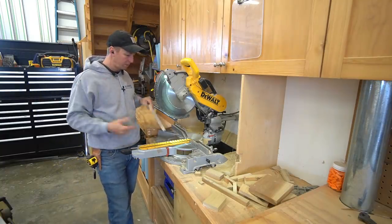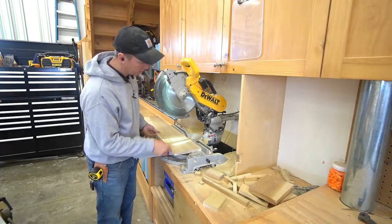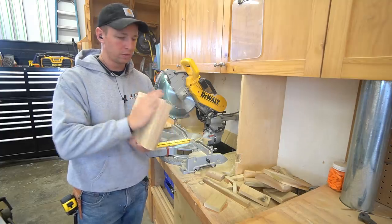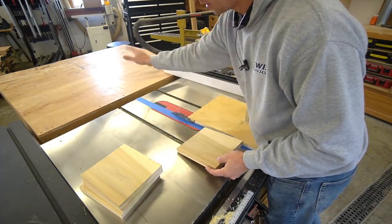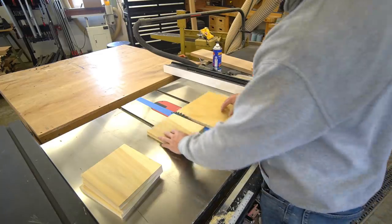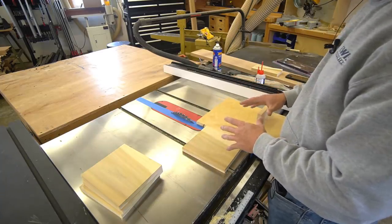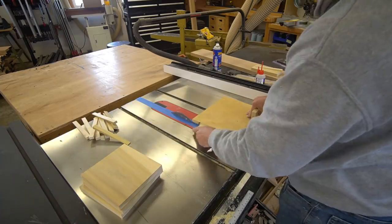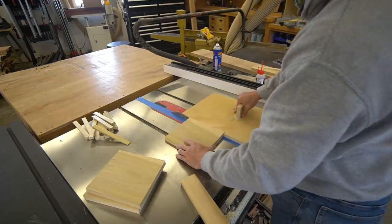It's time to make some shims. Just grab a piece of scrap and mark on your miter saw the length that you want — in this case I know I want eight inches, so I put a pencil mark there. You can batch cut a bunch of pieces to length really quickly doing it that way. The best thing to do would be to have a bucket on the backside where these shims could just fall into, but since my outfeed table's in the way I'll just push them to the side. You really got to watch your left hand — you could very easily cut yourself. I love having a SawStop table saw; it's just an extra layer of insurance. I've never set this off and I don't use it as an excuse to be unsafe, but it is a great insurance policy. Once you get to the end, just discard that small piece — don't get your fingers too close to the blade. It's just not worth losing a finger for a couple of extra pieces of shim.